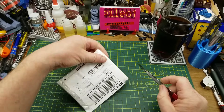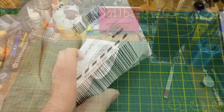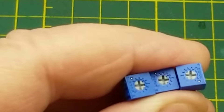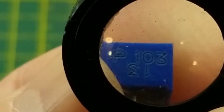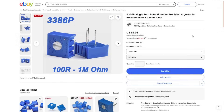Next thing in is something that came anonymously to my PO box. It doesn't feel like those same LEDs that I've been getting, so hopefully it's something interesting and different. Looks like we have three little potentiometers — there's only three wires on them. There's a marking on it: 103, so 10K pots. These took a fair bit of hunting to find, but this description finds them most reliably — 3386P single-turn potentiometer in various values. The ones I got are 10K. Looks like you can get a single 10K pot for about $1.76 Canadian or $1.24 American with free shipping.